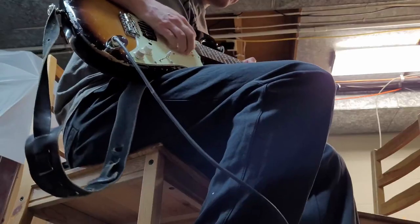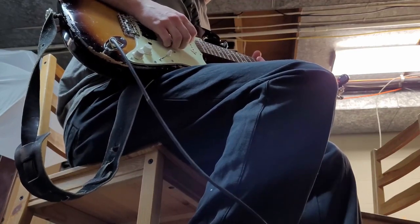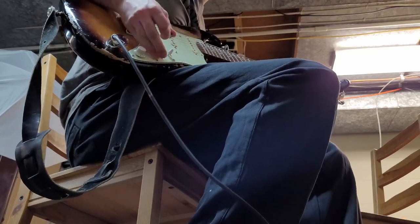And then second, I started getting a ghosting effect. But the best way that I can explain it is that, first of all, the tone just sounds a little bit muddier than what I would expect. There's not a lot of clarity to the tone in maybe a way that's hard to put your finger on. There's also kind of like, you have your primary signal, which sounded good and responded good like normal, but then there was almost like a ring modulator or almost an Octavia or a chorusing or like an 80s detuning type effect that was sitting underneath the primary signal and just kind of rubbing against it.